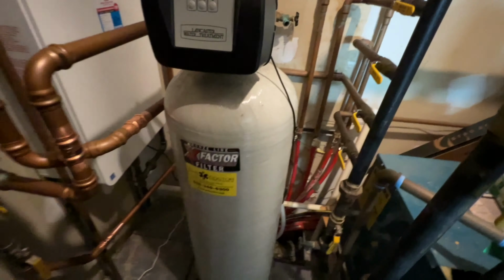And I'm gonna run the water again. We did just clean the boiler out really well, inside and around. They were filthy, plugged with like an inch of debris. Did a combustion test, it's burning safe. So we're doing a combustion test on the Bosch Greentherm as well, so we know that that's burning safely. And we should be all set here.